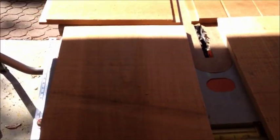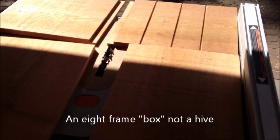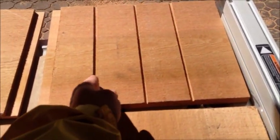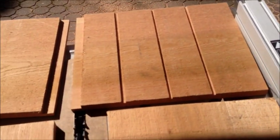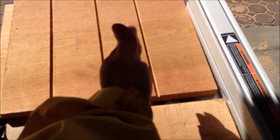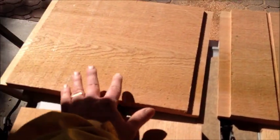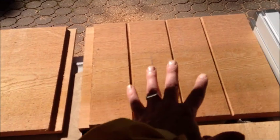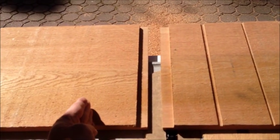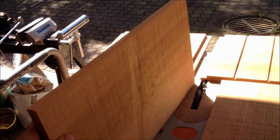So what this is — they're four pieces of wood that will comprise an eight-frame hive. The light isn't very good, but what I'll do is take the four sides and make a box. This is the short edge, and I've just cut one-eighth inch slots into that. What we'll do is take some hardboard and put three of those into each of those slots to make three or four compartments that will match up with that side. This side has not been cut yet — I just wanted to show it for reference. We'll cut three grooves in there, three mirror grooves in there, and then put a piece of thin hardboard in to connect the two sides and make the compartments.